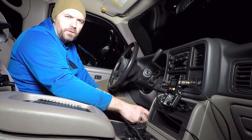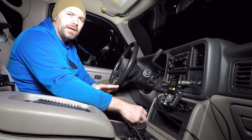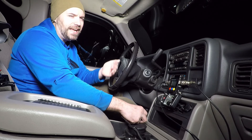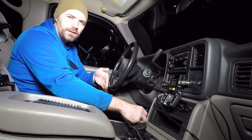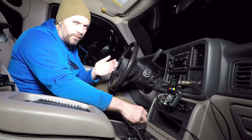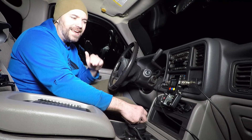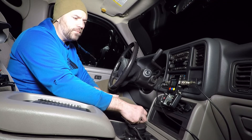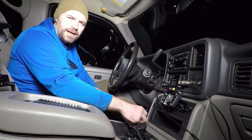Alright guys, so the Tram 1180 has been working really well. It's consistent across both bands in SWR and power output. I'm not getting my 50 watts of advertised power that this radio says it can handle. And I have sacrificed a little bit on the 70 centimeter band when compared to my Larson 270. However, the 2 meter band has jumped up substantially, and now I'm in that 40 watts plus and it's very consistent. So I think I'm going to stick with this Tram for now, and we'll see what I'll do with the Larson because it's not a bad antenna, and I know it's going to be good for other projects.